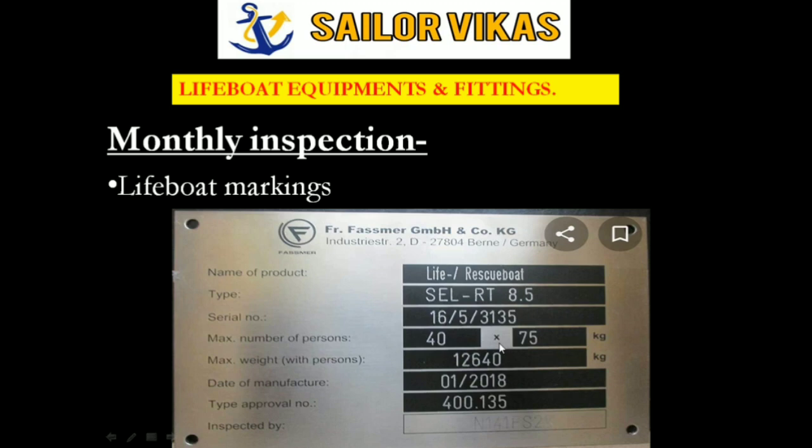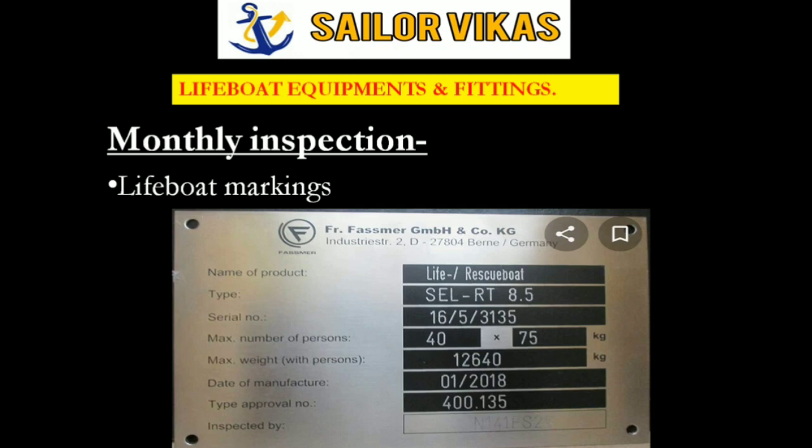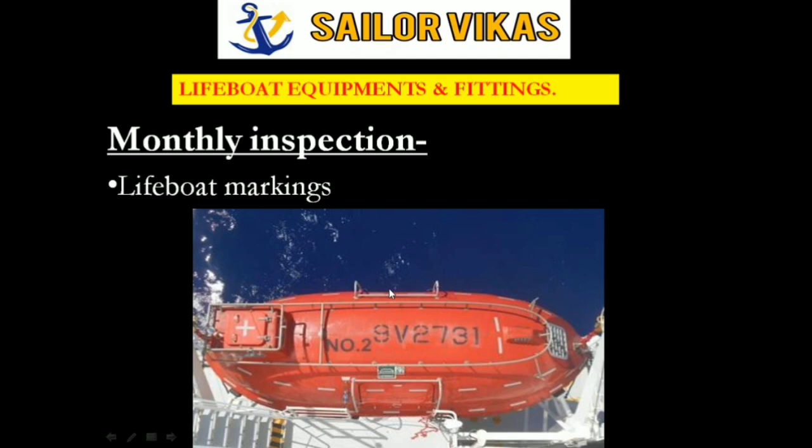If it is a free fall lifeboat, we will see three additional things. First is the free fall certification height, second is the required launching ramp length, and third is the launching ramp angle for the free fall certification height. This should be there, and always make sure that this plate is not painted over. So that was the first. Now the second is the markings on the hull.